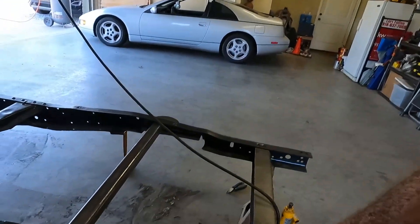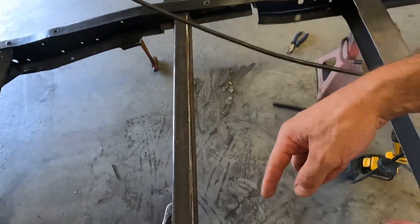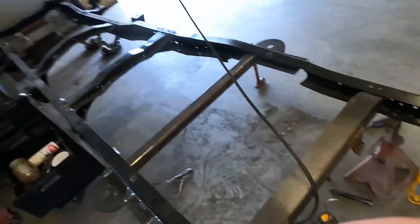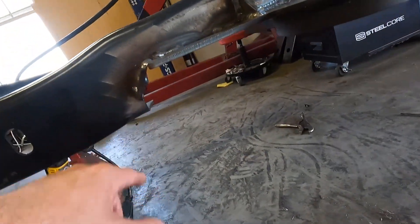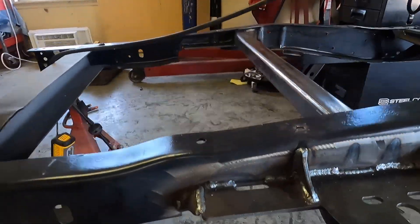If you haven't already, do me a favor and click that like button. It's freaking hotter than devil's donuts out here in July trying to weld and grind and sandblast and everything else. But these are completely burned in now on both sides, inside and out. I went ahead and welded a little gusset right down there because I didn't really like how that frame just sort of ended at 90 degrees, which makes me think there's probably a weak point. That's why I turned down this last gusset instead of making it upright, to kind of support the frame at this angle as well.